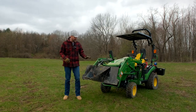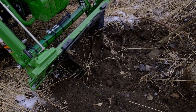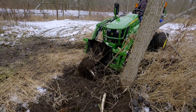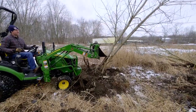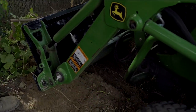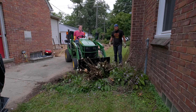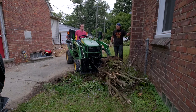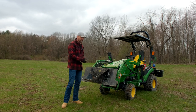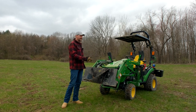This is the attachment I was using — a stump bucket. Most stump buckets on the market are a lot bigger than this one, so this is designed to fit a small tractor. What I was doing with the stump bucket is not considered abuse. What is abuse is when you have a huge lever extended way out there — some are three, three-and-a-half feet long that guys are using on tiny tractors like 1025Rs and Kubota BX. When you have that leverage point way out, like a breaker bar for lug nuts, and something gets tweaked, that's when you're going to have problems damaging your loader arms. We shortened everything up for subcompact and smaller compact tractors to take that risk away. We're about using tractors properly, efficiently, getting the most out of your machine, even if you have one of these little guys.